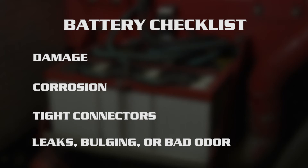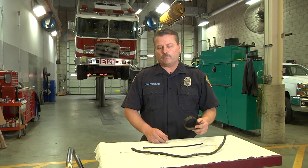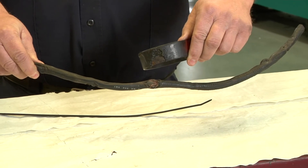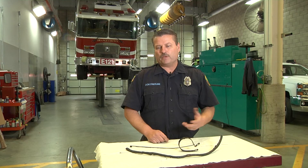Check if batteries are leaking — older batteries with fluid caps: take the caps off, inspect for fluid level, and see if the top of the battery plates is visible. Check for bulging on the sides or a bad odor like a rotten egg smell, which is usually sulfur burning on the plates — a sign the batteries are going bad. Write it up on a VR and we'll take care of it. What I have here is a clamp that shorted out on a battery cable because tie wraps weren't secured, causing the cable to rub through and melt. An engineer caught this and minimized further damage.